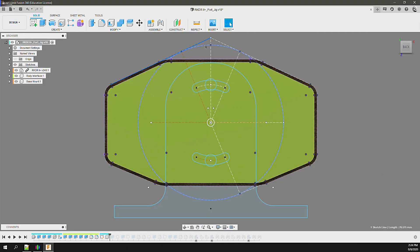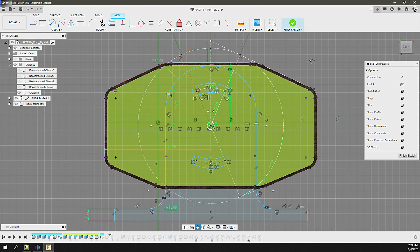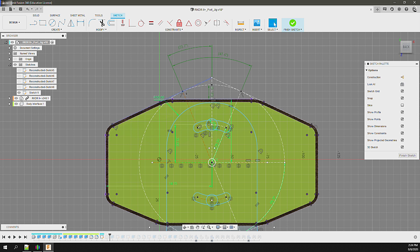First thing to do is find the center of the Arcader body. Next I extended construction lines out from the shoulders to identify their angles. To define the necessary range of motion, I drew an ellipse from the center of rotation tangent to both of those shoulder planes. It turns out the shoulders will require a plus and minus 23.7-degree rotation to position the body on the spindle's axis.